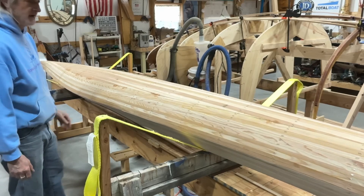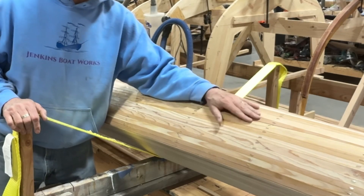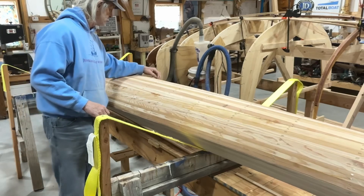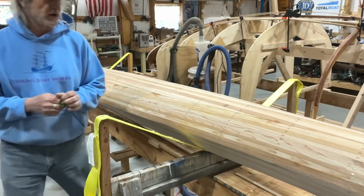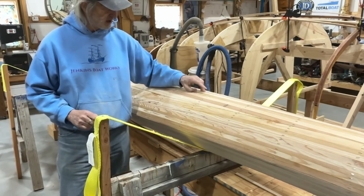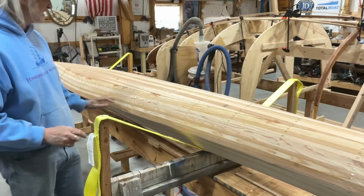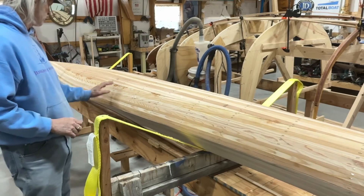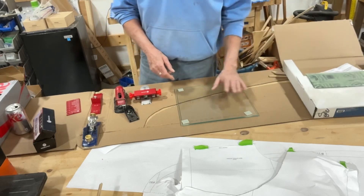What a difference! You can actually see here I had gone in with a little bit of glue and sawdust and filled in some of these cracks before we flipped it. There's another big spot right there — still tape on here too. So we're going to pull all the staples and then probably take a really sharp plane to it. I can feel ridges, and trying to sand those would take forever, so we'll knock the high spots off. May also use a paint scraper.